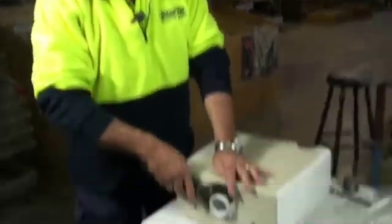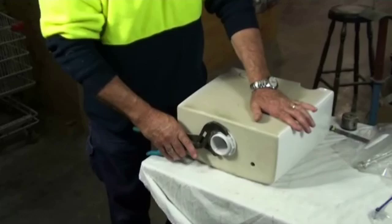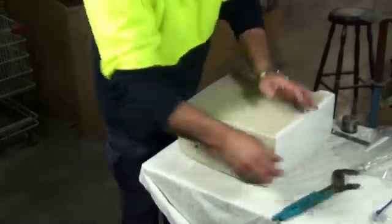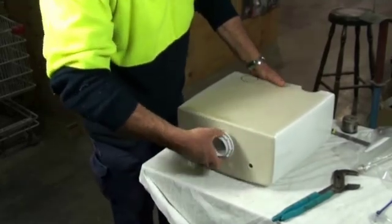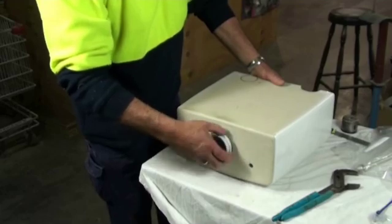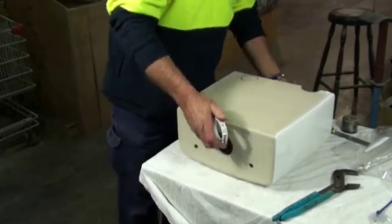Before drilling the hole, we need to take out all the flushing system inside. To do that, just use a pair of multi-grips and just release the big nut on the bottom of the system, just a couple of turns. It's not too hard — it's only plastic, you don't have to force it. And just spin it off and then just take it out.